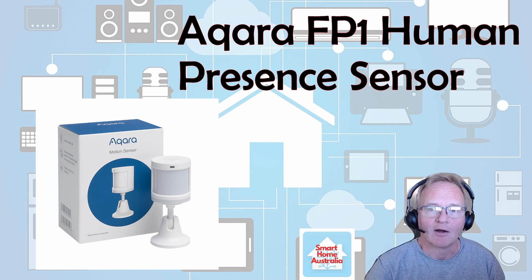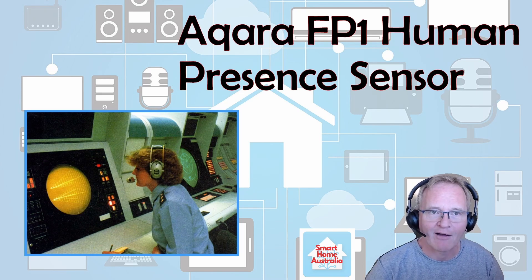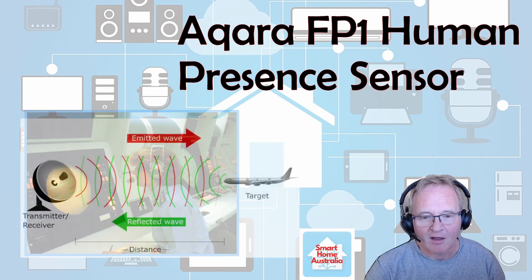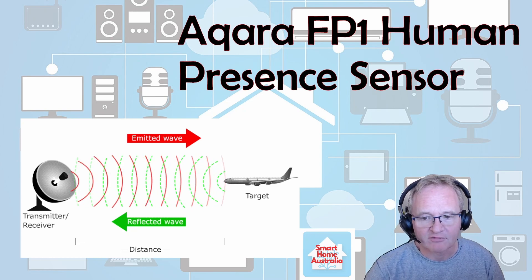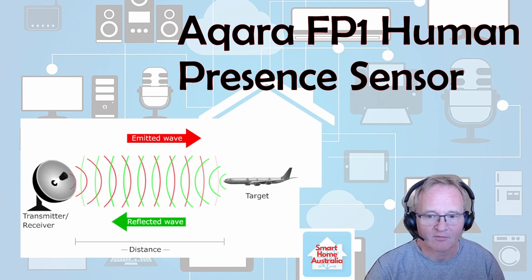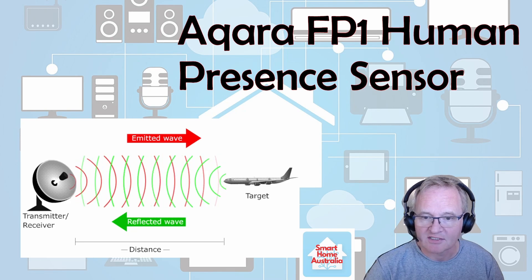It's millimeter radar — not the equivalent of an air traffic controller with high power radiation in terms of range and sensitivity. But it does the same functionality. A wave is sent out, it bounces off an object in its direct line of sight, and then it receives back the reflected waves. Based on distance, time, and direction, it can estimate how far something is away, or if it's moving towards or away from it using Doppler. Very powerful technology that we can utilize inside of Home Assistant.